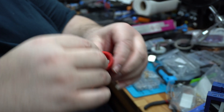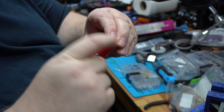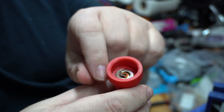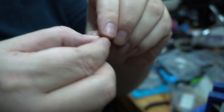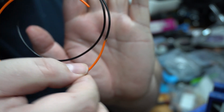I'll also show you later a video on how to modify the nozzles. Now you can see — this is real-time speed, no sped-up footage — both ends are melted together. This is the magnet; you need to glue them in. On my prototype they're not, as I said, it's freshly out of the printer. You melt both ends, put them together, and there's too much material. But when the two nozzles meet at one point, they work like a knife and cut the filament. You put it together, turn it a little bit to help cut.